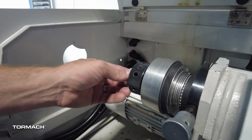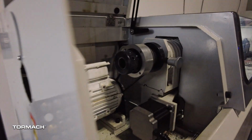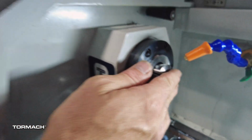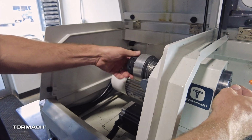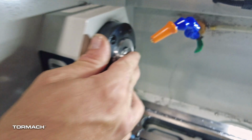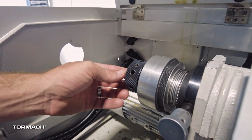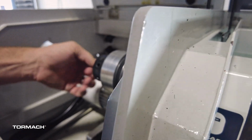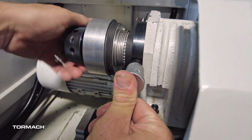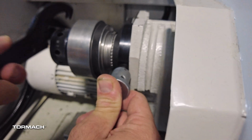The spindle supports a 1-inch through bore with the access port on the side of the machine so you can put stock all the way through if you need to. When you want to replace your collet or put a chuck in, you have a thumb wheel back here. And when you put your stock in, come through here. To lock the 5C collet, use the spindle lock and a spanner.